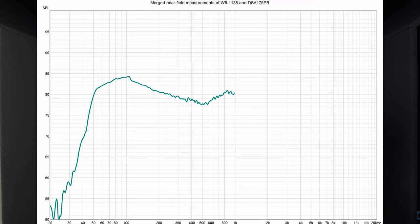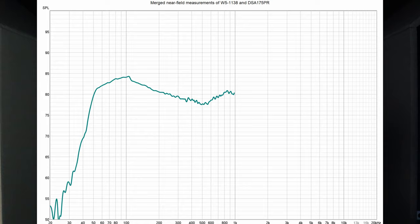What I'm recommending is that you get an external 2.1 amp like the Arilic one, get an enclosure for it, and use that instead — it also has Bluetooth connectivity. How do these sound? The sound is very similar to our previous set with the Dayton Audio drivers, except in a much smaller footprint. The bass extension from this subwoofer is the same as the larger one, so we get about the same frequency response in a more compact size. With the five-inch driver there will be more cone excursion at loud listening levels, and the three-inch full-range drivers will be directive at high frequencies, but that's just the nature of a larger full-range driver.